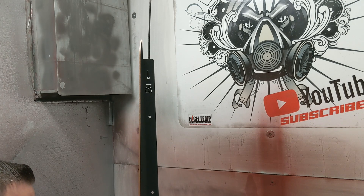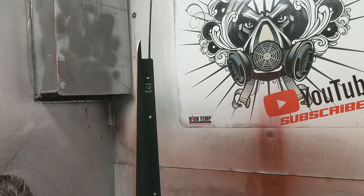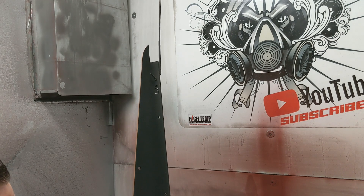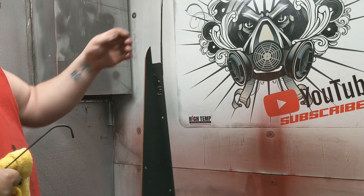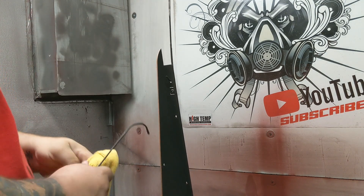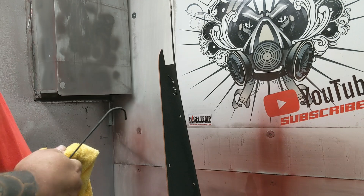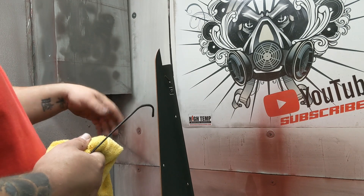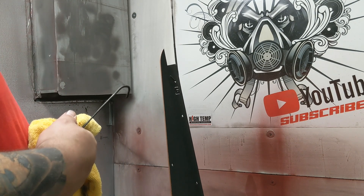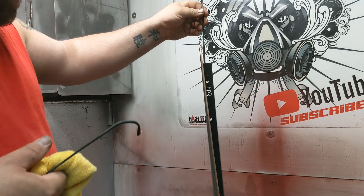It's really this simple — you're wiping off the powder that you don't want. I've done two-tone stuff on this channel before, and I have another two-tone project coming up. It's the exact same process — it doesn't matter: diffuser, wheels, whatever. You spray powder where you want it, and then you wipe it off all the places you don't on your second coat. The one thing to remember is some colors don't interact well, so I did a test shot to make sure — I sprayed fireside copper on a panel, then tuxedo black over top, with a piece of tape so I could see a defined line and check for any bleed-through issues. It all turned out well, so we'll keep going.